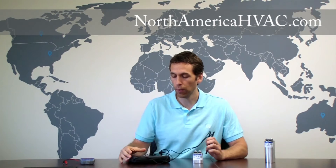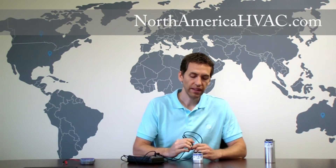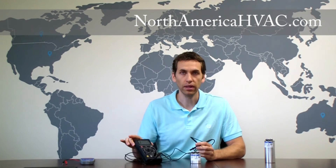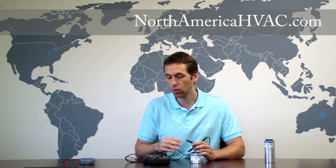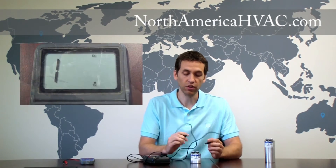We'll take this capacitor, turn our voltmeter on, and we want to go to the ohm setting. I like an ohm setting of around 200k — it's probably the best setting to work with. The voltmeter has a 9 volt battery. What we're going to see is when we place our leads on the capacitor, the capacitor stores electricity and it's going to begin being charged by the 9 volt battery in our meter. On the ohm setting at about 200k, we're going to see that the ohm reading when we apply our connectors will rise up.